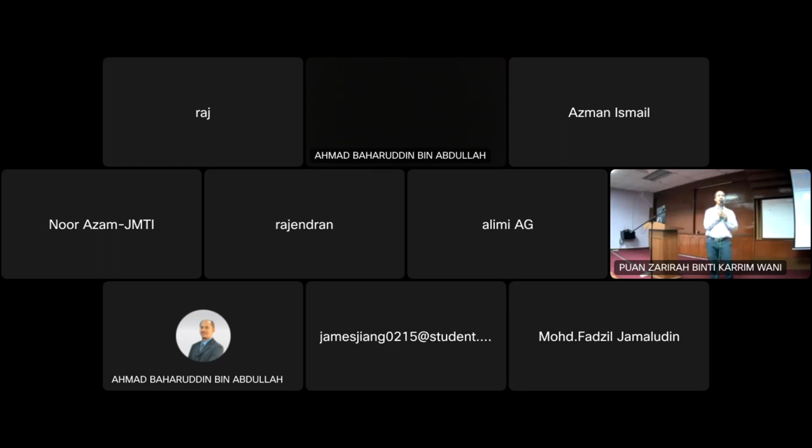See, the question you are asking is, when you have friction stir welding joining two different materials, we need to look at how the material is being affected. When you talk about aluminum, the melting point is something like 690 degrees centigrade, depending on the alloy. But what heat treatment are we talking about, annealing or what type of process, because one is ferrous and another is non-ferrous. We need to look into that case by case. Sometimes we do it at a lower temperature, something like 500 degrees centigrade, depending on whether we are trying to relieve the stress or improve the properties.